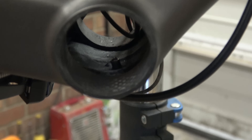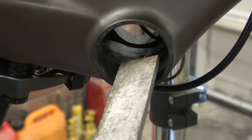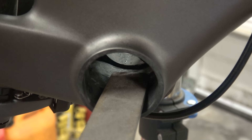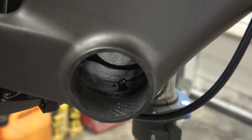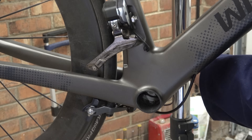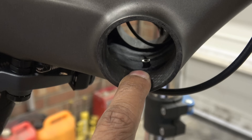It's slightly proud. So this is just a fairly fine metal file. What I've done is backed that screw out slightly because it's harder than the aluminium around it, and literally all you've got to do is file. That's a bit more difficult with me holding the camera and trying to file, but you could also use a Dremel if required. If you are going to use a Dremel, I suggest you come from the opposite side so you can see when you're dremeling. It didn't actually need dremeling but I've dremeled it anyway for the purposes of the video.